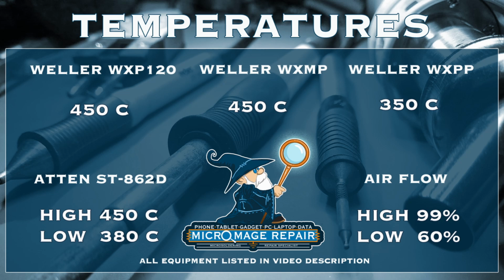So these are the updated Atten temperatures. So 450C at a high 99% airflow for the iPad connectors. I did lower it down to 60% when putting it back on. On the iPhone, I did 380C at 60%, and I never changed it for removal or placement. We didn't burn any connectors around them or anything like that. It was a good working temperature, at least here in my climate, high altitude, dry. Today it's pretty cool, so that can make a difference.